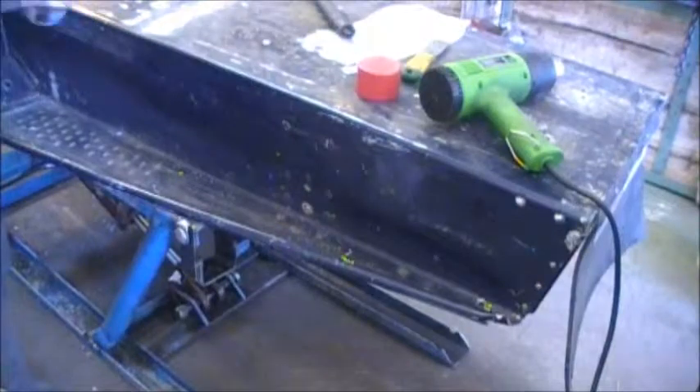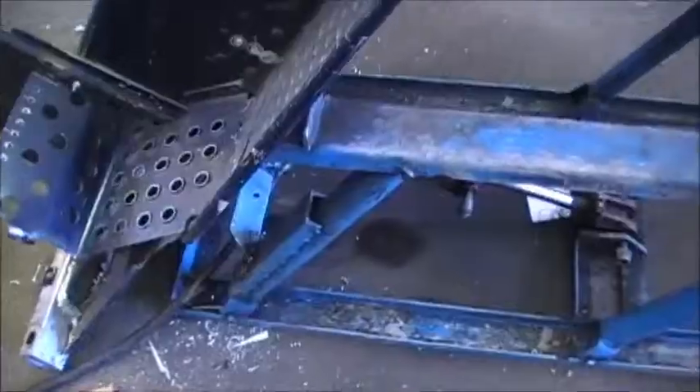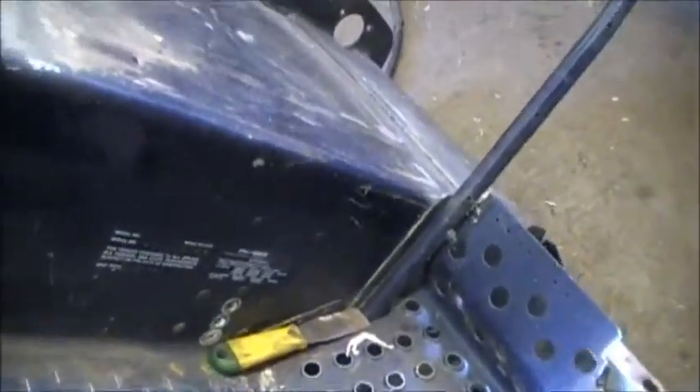A second application may be necessary. For the most part the glue is off. There is a slight film in places so I'm going to have to work on this a little more. I won't strip this chassis right down to bare aluminum - I will give it a light sand and it gives a good result.